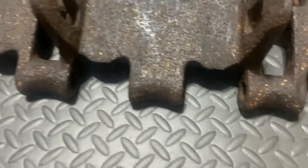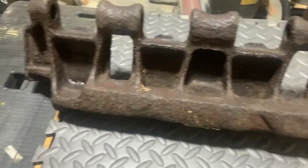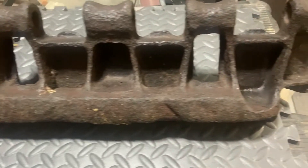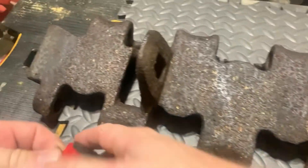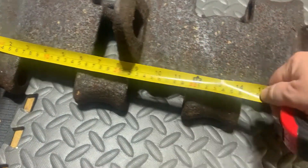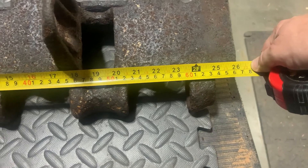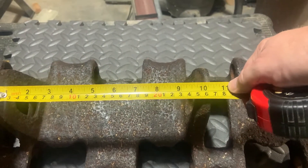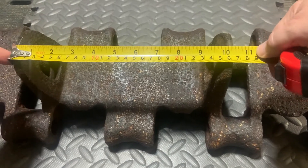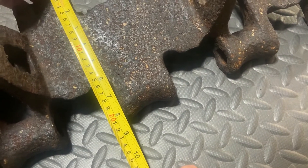We've got the two track horns, the two holes in the casting for the guide sprockets, and on the front here we have a large deep web and a solid bar. You can just make out the triangular remains of the grouser. Measuring with the tape, this thing is 660 or so millimeters wide — that's 26 inches — and 26 centimeters between the guide horns, about 10 inches, and in depth about 200 millimeters, about eight inches.